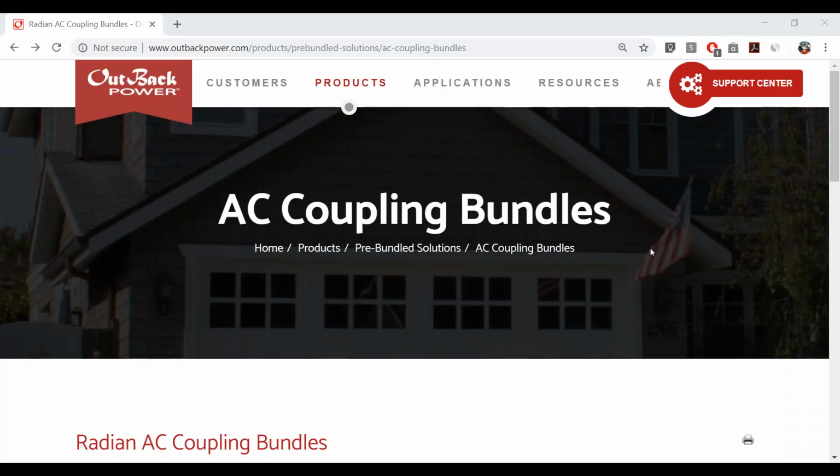I don't have any easy way of seeing where everybody is calling in from on this webinar, but we already know that out here on the West Coast in California, the utilities have started doing the scheduled blackouts. So I think we'll certainly see some demand for AC coupling resulting from those. In general, utilities trying to adjust net metering programs and feed-in tariff programs are going to probably drive demand for AC coupling for folks that have installed grid-tied systems and are close to that payback period. Maybe their system already paid itself off, and now they want to maximize that return on investment long term by adding some energy storage.